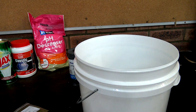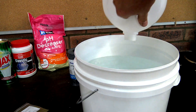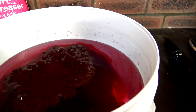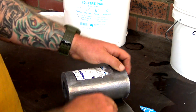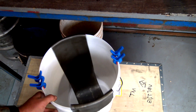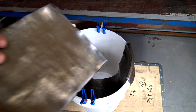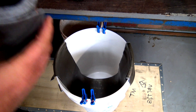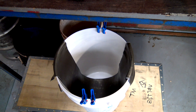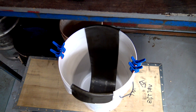Since this is my first time having a go at anodising at all, I decided to go with Caswell's Deep Red. I went with Caswell because it's tried and tested. I'd like to test other dyes later, but for now I'm going with something we know works. The next thing I needed to grab was some lead. Lead's quite easy to come by until you want it, then it's hard. I ended up buying a roll of lead — costs a little bit, but there are cheaper ways. You could just walk around the beach picking up sinkers to melt down into plates, but I didn't have time.